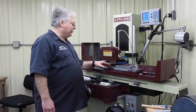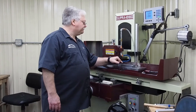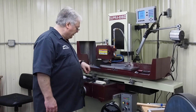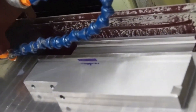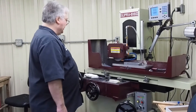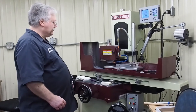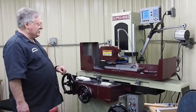I got the surface grinder set up now. I lightly touched on here to show how it's grinding a little bit lower on the two ends and the middle is not on the same surface. I took a marker, inked it up, and you can see there's a little strip grinding here, a little strip there, and in the middle it's still high. I'm going to go ahead and turn the coolant on. Before I do that, I'm going to take a white stick and clean the wheel out real good, because I want to show how you can use this method to find what's high. We're going to mute the sound for this next part because the coolant pump is quite loud.